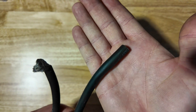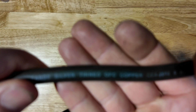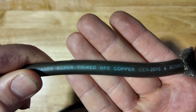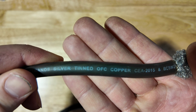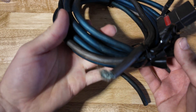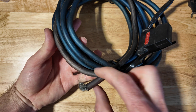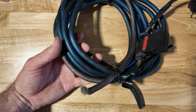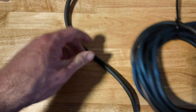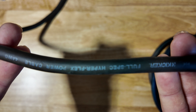For cabling, I highly suggest you buy oxygen-free copper or pure copper wire. You can tell if you're buying speaker wire, for example, because it says OFC tinned — so this is pure copper tinned copper wire. You don't want to use the other type called CCA, copper clad aluminum. It feels a lot lighter than real copper and tends to be cheaper made. For solar and battery applications, you really want high quality copper cable so you don't have any issues with heat or oxidation.